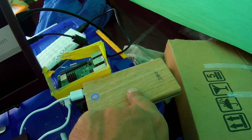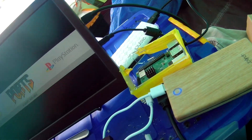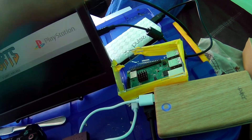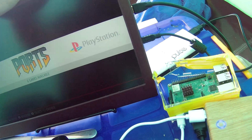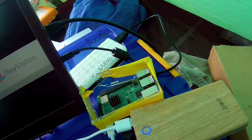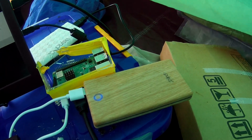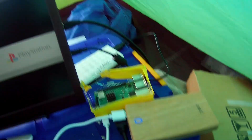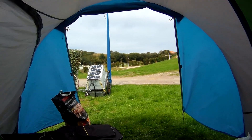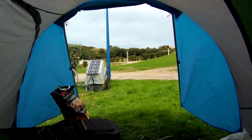Now I'm powering it with two cheap power banks. This one is 10,000 milliamps and this one is 8,000 milliamps. I power the display with this one and the Raspberry Pi with this one, because the display already takes 1.4 amps. If I would power the display and the Raspberry Pi with the same power bank, then the Raspberry Pi would shut down — these power banks don't have enough juice. But my big power banks are charging right now: 26,800 milliamp-hour batteries with my solar panels.